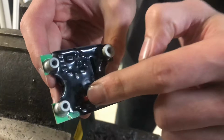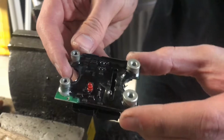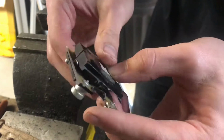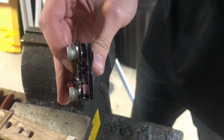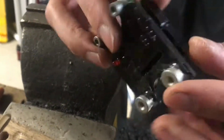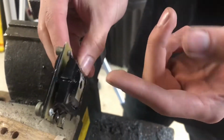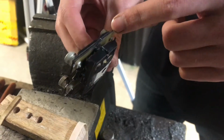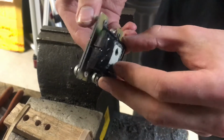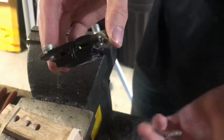Of course, this is the indicator LED that turns on whenever you apply 3 volts or more to the input. You can see the leads of this transistor package coming up through the circuit board. They kind of connect onto the top. It's interesting, the way that they did that. Oftentimes the transistor, when it's laying flat, will just be soldered directly onto the circuit board, but they have it raised up, perhaps for better thermal properties. They didn't want the circuit board heating up too much in case the transistor got hot.